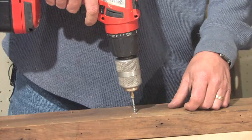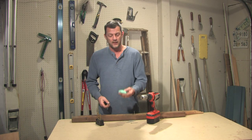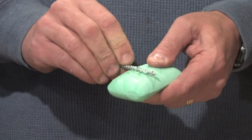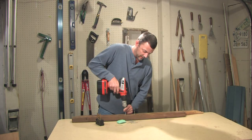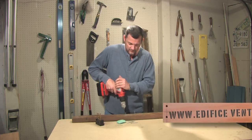You can see that our screw goes in a lot easier. The second method is a lot quicker and easier — just use a bar of soap, take your screw, and rub it on there a little bit. What that does is put a little bit of soap on your screw, which gives it lubrication so that it goes into your hardwood much easier.